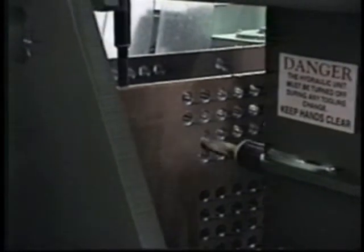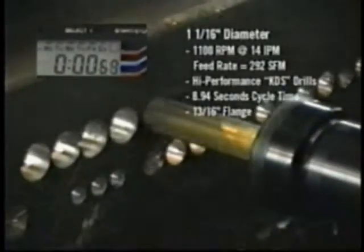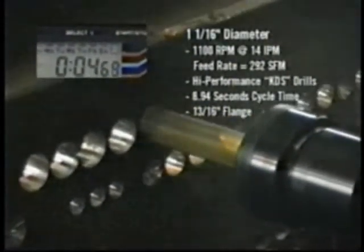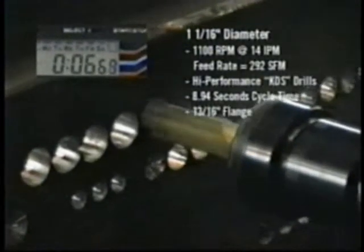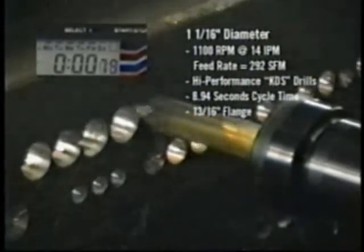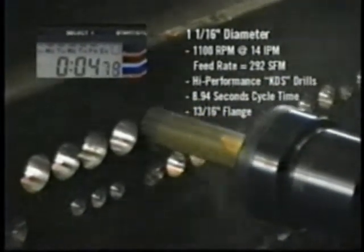The CNC software will equally gauge the hole dimensions between the web location. Aggressive drilling up to 1 and 1/16 inches in diameter can be accomplished. The air mist coolant system is adjustable from a near-zero liquid to a heavy mist based on the type of tooling used. The radial rake angle of the carbide tip drills produces a short curl chip that can be easily evacuated.